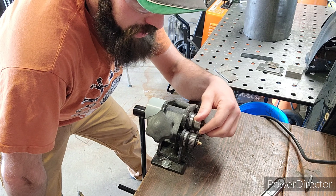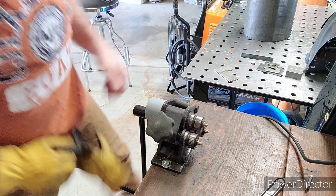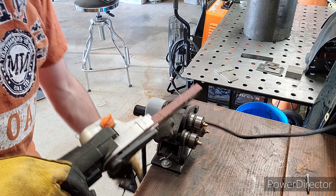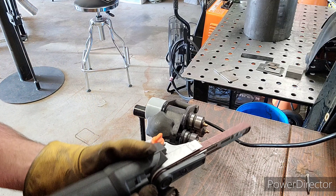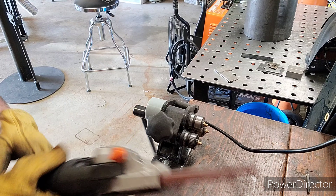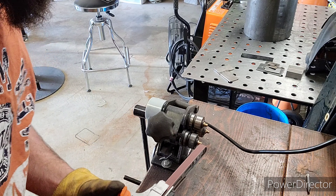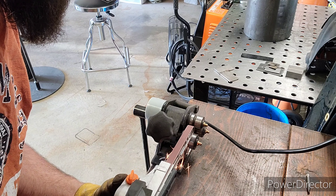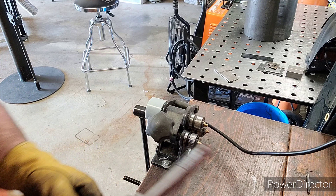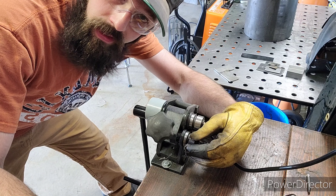I've got most of the knurling on these wheels knocked down. I'm going to do a quick demo on how I'm doing it, including this third wheel, because this wheel is not connected to the other two by the gear. This Dyna file moves in this direction, so I'm going to use that to my advantage while I'm cranking - cranking the wheels in the opposing direction so it kind of helps pull itself along. This third wheel will spin on its own just by pressure from the Dyna file, and that spinning action helps put an even grind on all these surfaces.